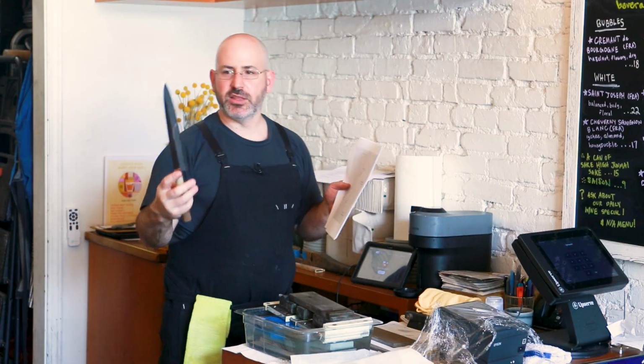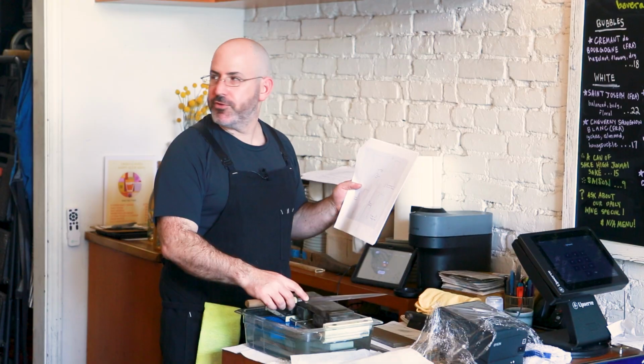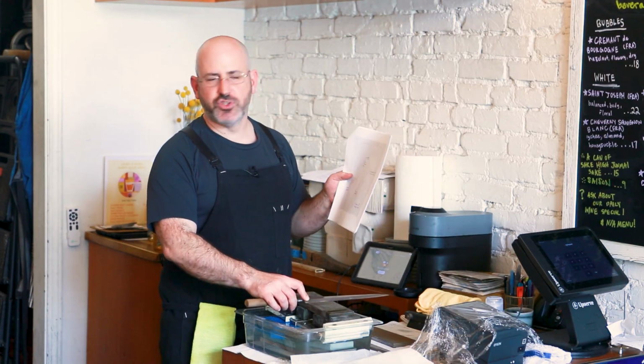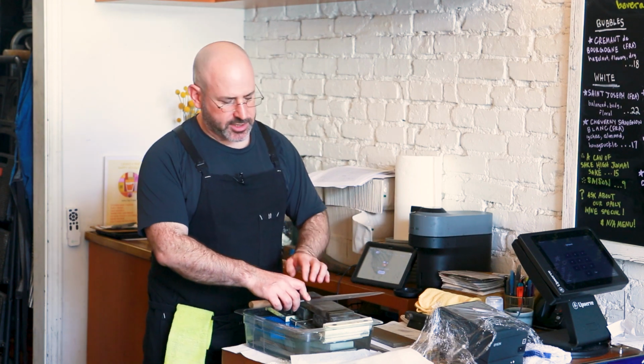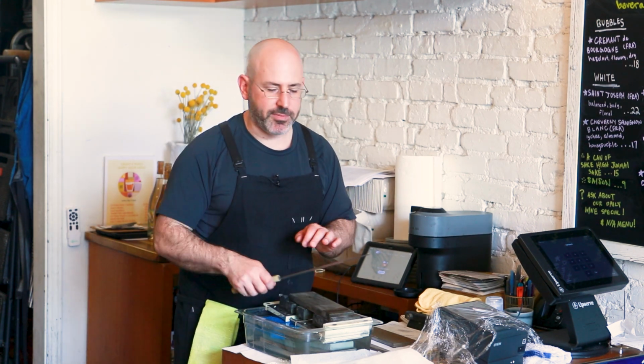When we sharpen, the backside goes totally flat on the stone, not ever lifting up. If you lift up, that is one of the other seriously messed up things you can do to your knife. Please don't do that. I hate fixing it. It sucks. Flat on the stone. Our fingers are on the shinogi line, and this is the way that we're going to sharpen the backside.